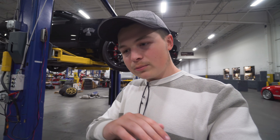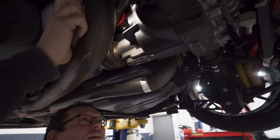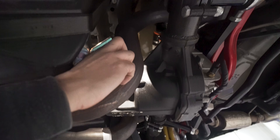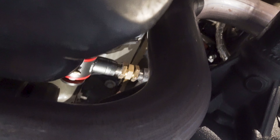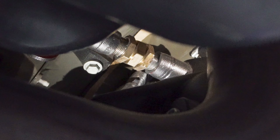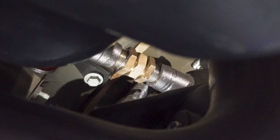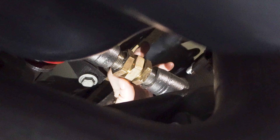I'll show the video of what they said about the issue right after this. See this adjuster right here? There's the center adjuster and then there's two jam nuts, and the jam nuts aren't jammed on the outside. I've got some Teflon, some Loctite residue right on the bottom here, but obviously you've got to lock these things — you've got to put some Loctite on them and cinch them on. I don't know if maybe we had contaminated Loctite or maybe the vibration was too much.